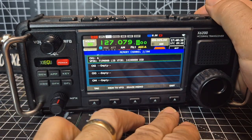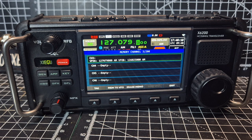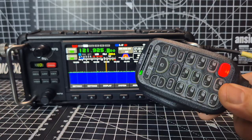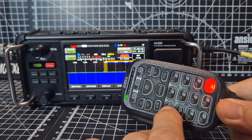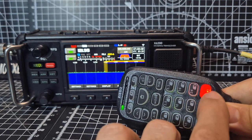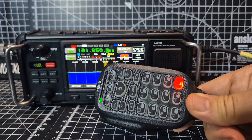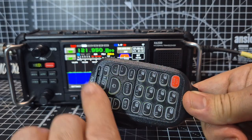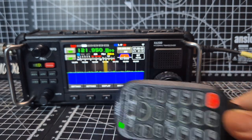You could probably save some frequencies to memory. Turn the large VFO — there's an empty one there — press save. You can even tag it, so if you get your favourite frequency you can type it: press enter first, then type one, two, one, dot, nine, two, five — or let's put 0-9-5 — enter, and it puts it in. Just remember the white parts are the numbers; it's quite confusing because there's a lot of black, but count one, two, three, four, five, six. You need to remember to put the dot in and you don't put in the last zero.